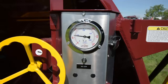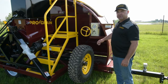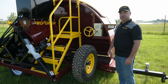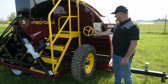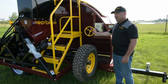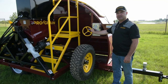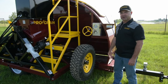The control panel has an oversized brake gauge so it's easily seen from the combine, cart or truck. You want a consistent brake pressure to fill your bag evenly throughout the whole bag. It can easily be adjusted with the adjusting wheel here, up or down. As the heat of the day increases you may need to adjust it down, and as the day cools off you may need to adjust it up. Keep it consistent and your bags will end up full with no air pockets.